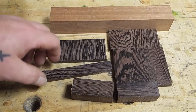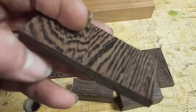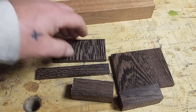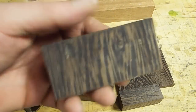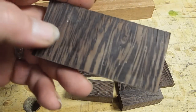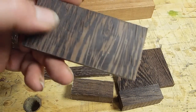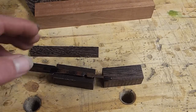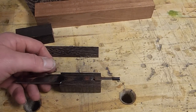So here's what I came up with after digging through my empire of dirt here. You have a ton of grain in a little tiny area, just super high contrast in the grain on Wenge, if you guys aren't familiar with it at all. I love this stuff for that. The problem with it is it's really prone to tear out and splintering — you've got to be real careful with this stuff. If I do a stacked design, I can get Wenge in there somehow.